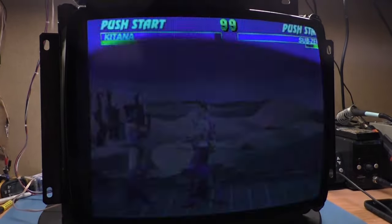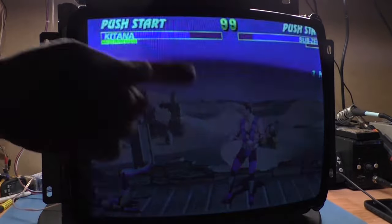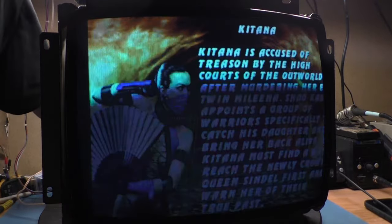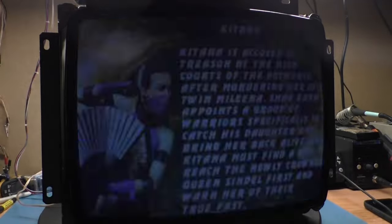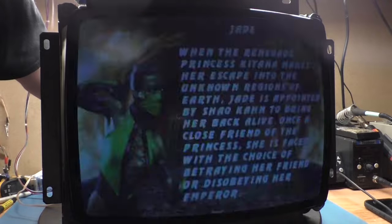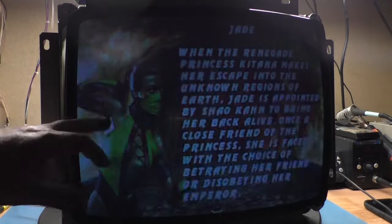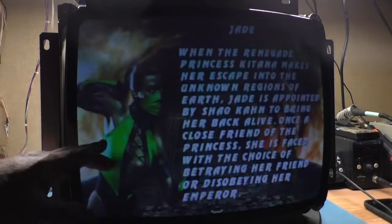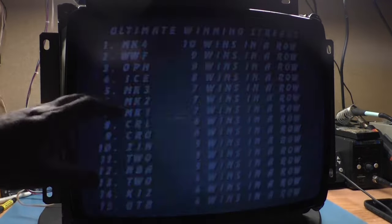Man, I'm sorry about the refresh rate there, guys. This camera is so cheap that it doesn't have an option to lock it into the 60 hertz refresh rate. So, okay, H position, move that over this way. And I'll say right there. Actually, let's turn our contrast down slightly. That's better. Yeah, this tube is just a bit tired. Oh, I know what was happening. The green gun was shorting. That's what was happening: we got that flash of all green and we had the retrace lines. That's a green gun shorting out.